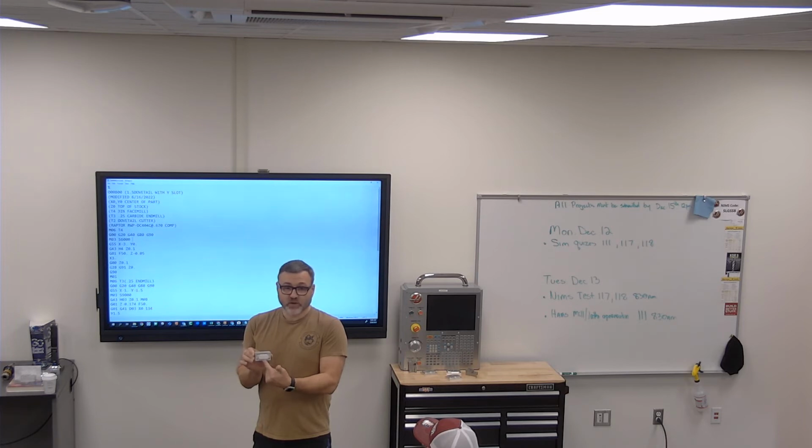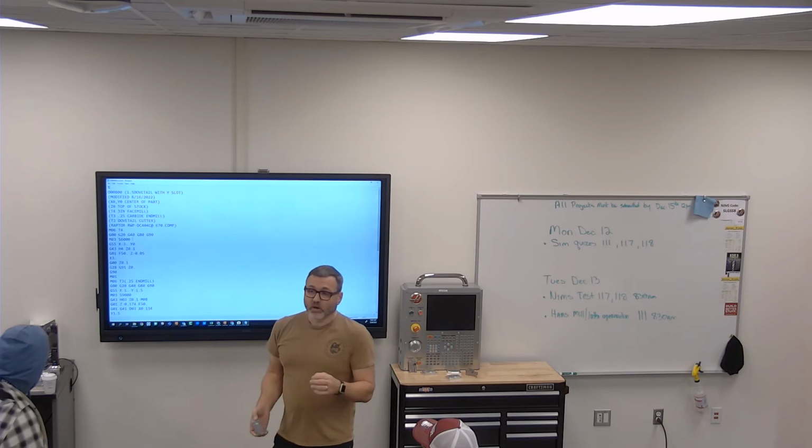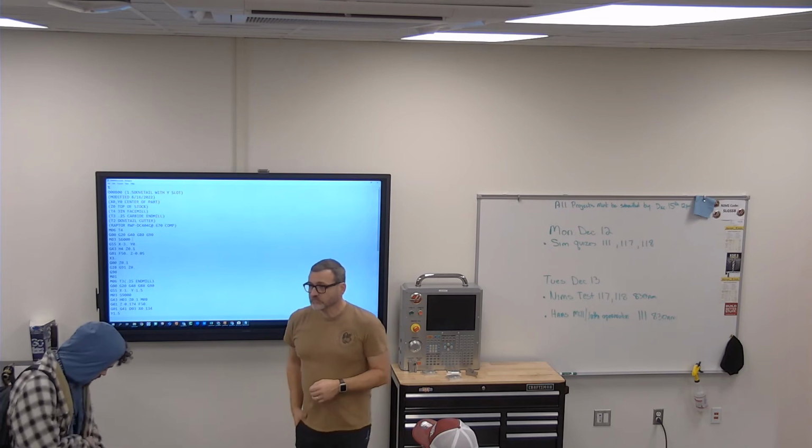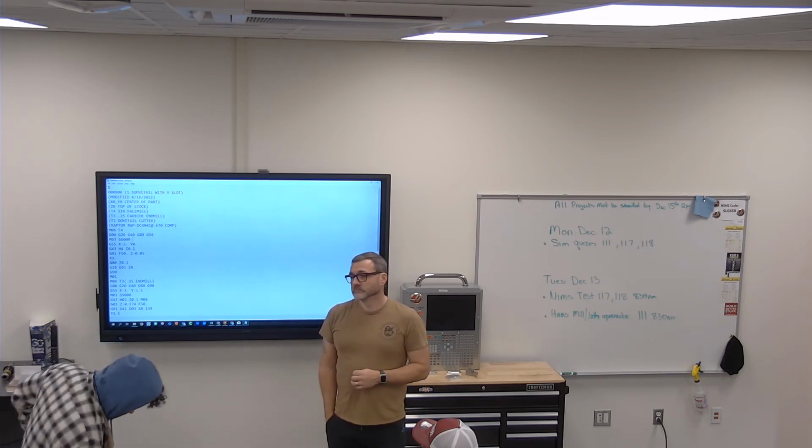It's gonna go 2 inches from this point, not to -2. It will go from where it's at, 2 inches. So for us though, -2 inches would be just another inch from the inch, right? So you go -1, -2, -3, it would really go 1 inch, 1 inch, 1 inch. If you're in incremental, it would move 1 inch, then 2 inches, then 3 inches. Why is it that way then? Does it just tell the tool that's 0?